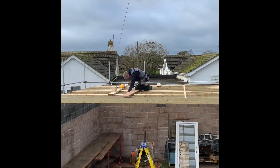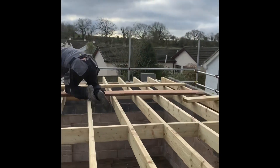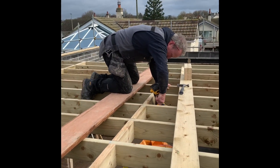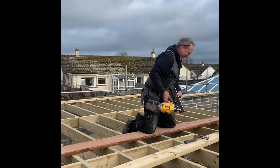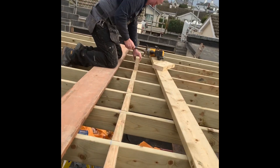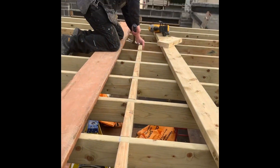Coming to the end of the floor joist video. This is Ian from the poshest place on the planet. Technically these aren't called noggins — they're called solid floor strutting — but everyone calls them noggins. Here's the gasless nailer: the world's first fixer. A bit heavier than a Paslode but good for the exercise — no need to worry about gas. You can go either side of the line, or keep them nicely straight. Put a line here, come in the same measurement at the top, and ping the chalk line to work to. Thanks for watching.